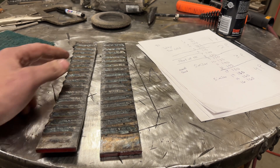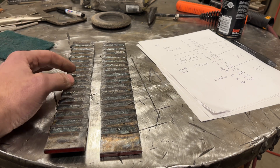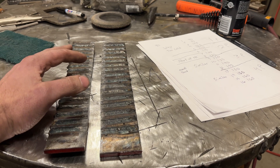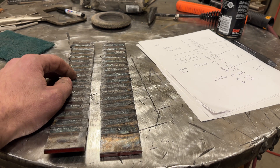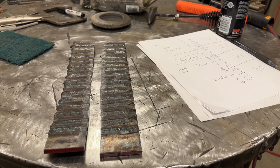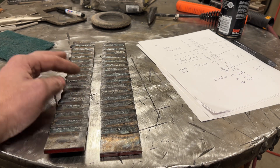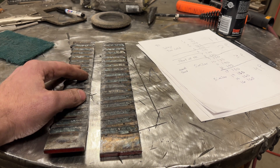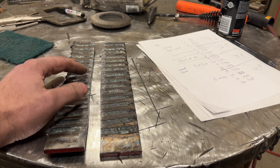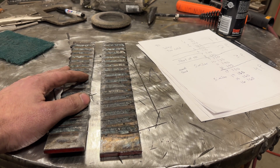When I was first learning to stick weld, I'd use like 120 or 125 amps doing fillet welds. You can do a fillet weld on quarter inch at that, but I'll tell you what, it's going to be lacking penetration without a doubt. Once stuff gets preheated, 120 to 125 amps works. So don't take it as that you have to run higher amperage — preheated plates take a lot less heat than cold plates. Just don't be afraid of amperage; run the appropriate amperage. Anyways, my next video I'm going to run fillet welds with 7018 and we're going to do a cut and etch. I won't do this many fillet welds — I'd be at it for two days straight. But I'll do a couple, three, four different amperages and we'll actually look at it and see what we find. I think it's going to be pretty telling because the minor differences in this plate are going to be significant when you're talking fillet welds. Anyways, thanks for sticking around, I appreciate it. Till next time.